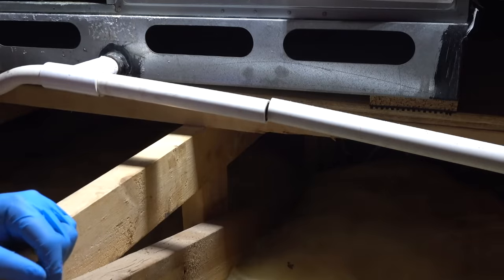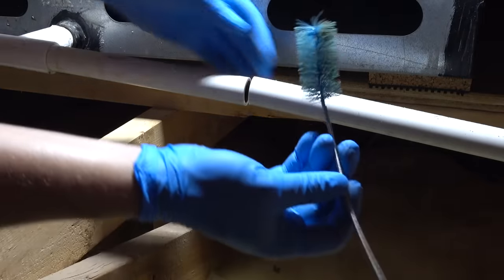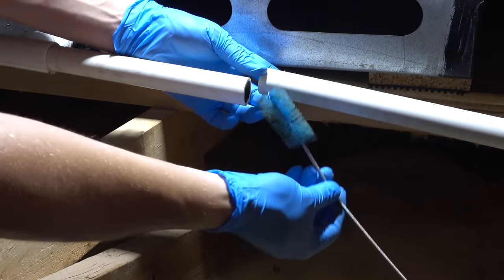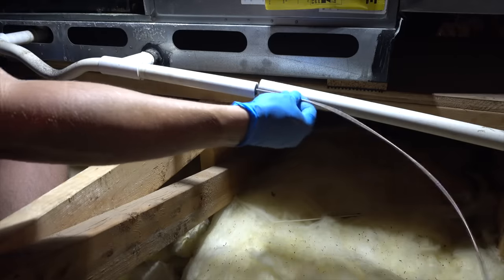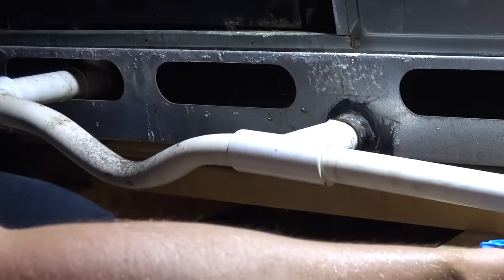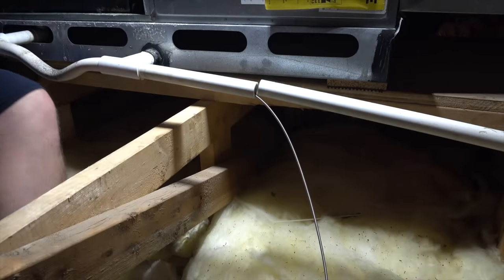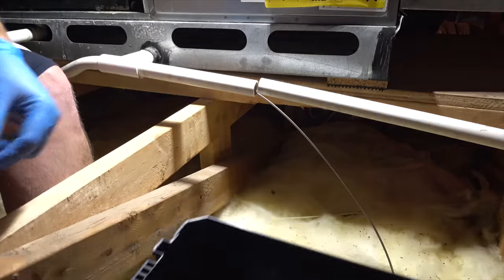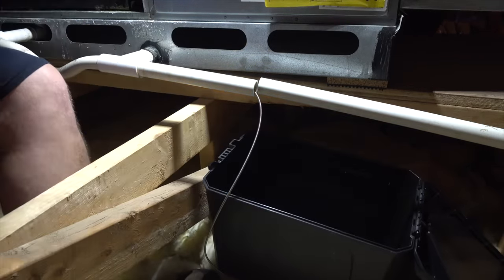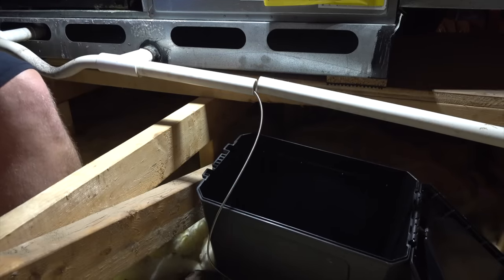As you can see, there was no water in the line, so it wasn't a problem. This is where the inexpensive brush really pays off — I'm going to stick it in the pipe and start feeding it back in. The brush will go right into the trap, follow that curve, and scrub it out. These clogs are typically very loose material, so a brush like this will completely clear the pipe and make it like new inside. Work the brush in and out, then slowly slide it out — have a bucket handy because you'll see what comes out.